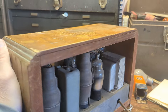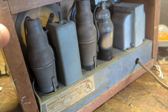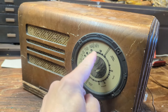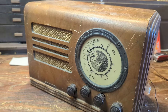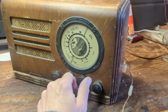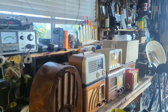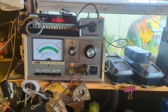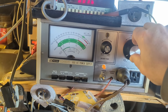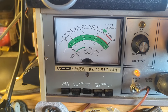I think there's a disc inside that spins and goes around this dial here. It doesn't have a power transformer, and if there's anything shorted on it we'll want to know. So I want to start it off on the lowest amp setting and bring it up slowly. You can see it's drawing a little bit, but not much.